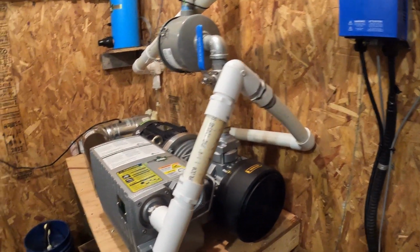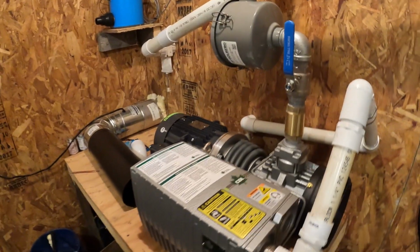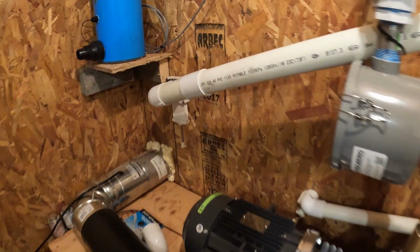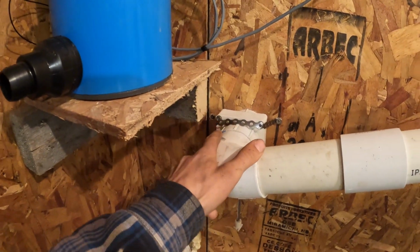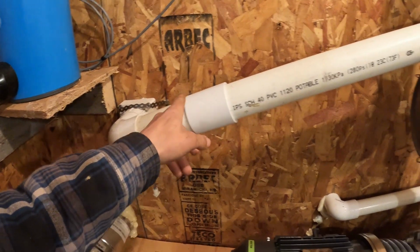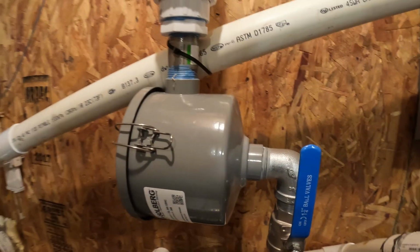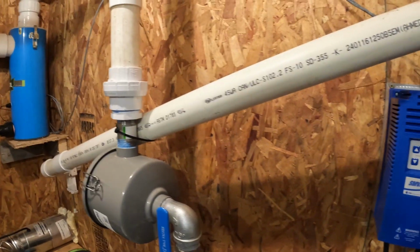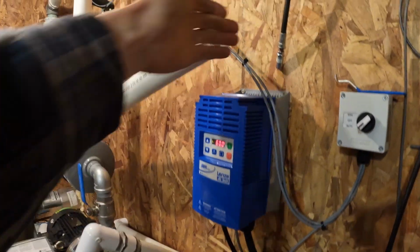The other thing to think about is how to get some fresh air inside the station. The door is not the best option to keep open because at night or at the beginning of the season, you don't want to go to your station, open and close the door every morning and night. In this case, I installed a 2-inch pipe and I try to take the airflow as far away from the fan as possible so I get air circulation. In this case, I'm close to the drive, which is good to keep the drive cold.